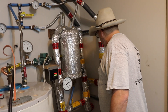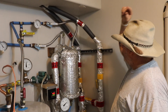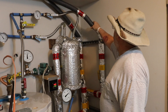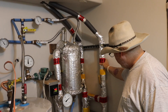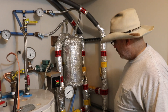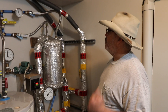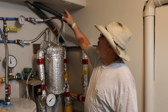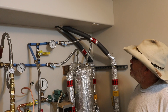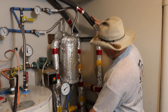I energize that furnace and send water back to the furnace and then back down. Everything here is one-inch PEX, and behind the wall it's all one-inch sweated copper. This tank is stainless steel and so is the heat exchanger. So I went from PEX to copper. I'll show you the furnace — I ran these lines in fur downs. I've got a fur down running from here all the way to my furnace where I have my heat exchanger.